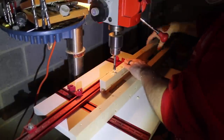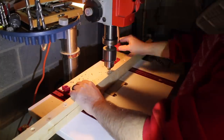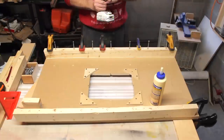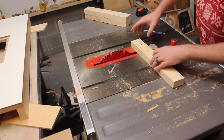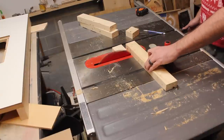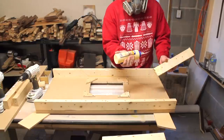But first I work on a frame for the table top. Here I'm drilling some holes for some screws — my screws were a little too short, so that's why I used the Forstner bit just to get them a little bit deeper. I add glue to one side, clamp it good, and then drive the screws. This will add extra rigidity making sure the table surface stays dead flat forever. The legs are cut at a 5 degree angle and I used two powerful magnets to mark the location to make sure they're all the same size. Then it's on to attaching the legs — I drill some holes, add some wood glue, and attach them with screws.